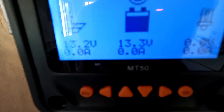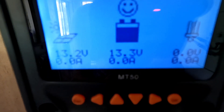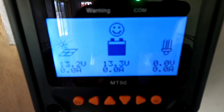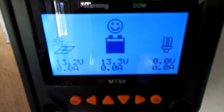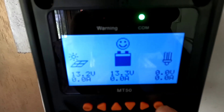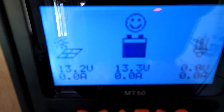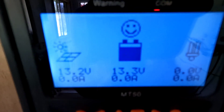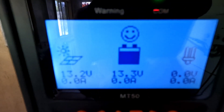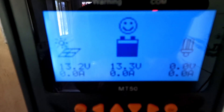And there's the top string — not good at all. 13.2 volts, zero amps being pushed into the system. This started a few days ago and it has not gotten any better. No power coming into the bank whatsoever. That 13.2 volts is not enough voltage to push a single amp into the system. It should be up there around 80 volts as well. It's not.